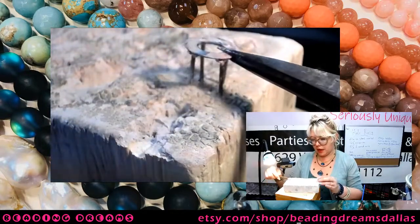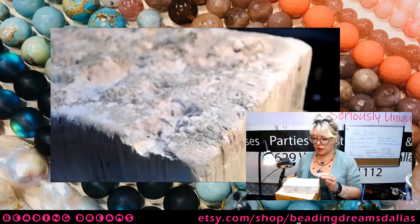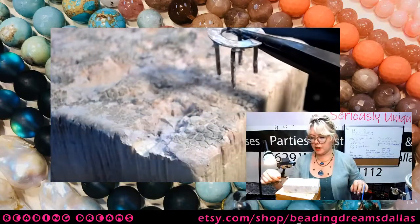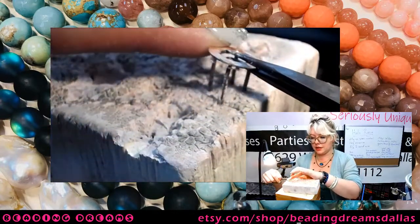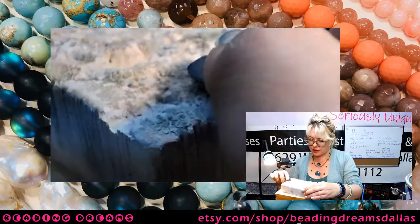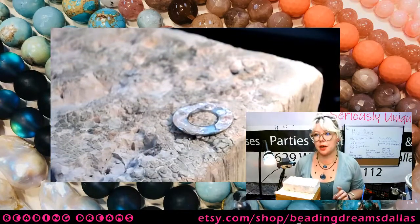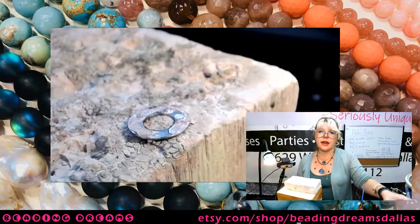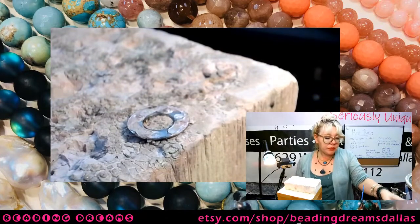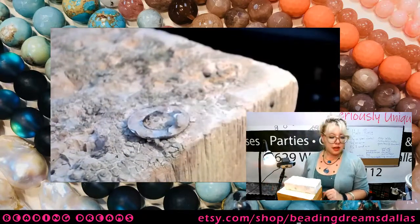find another spot in my soldering board that's fairly flat. And this one, notice how that one's kind of cattywampus. I'm just going to straighten that one out a bit with the pliers, because this is hot. There we go. I'm just going to find another spot on my solder board and press that right back down. That's just so that everything is nice and supported while I'm soldering on my band, because even though I'm going to use a lower density of solder for my band, I want to make sure that if my solder reflows on my prongs, that they're supported. So now I've probably got plenty of flux back here, but I'm just going to reflux the back of my setting.